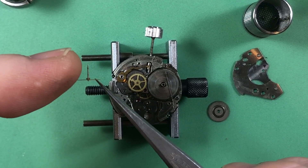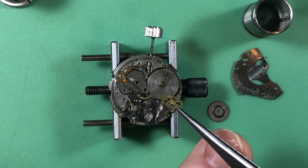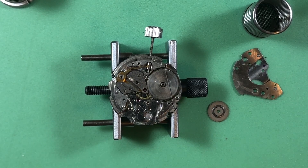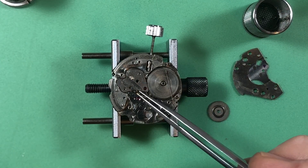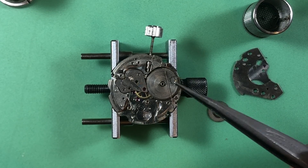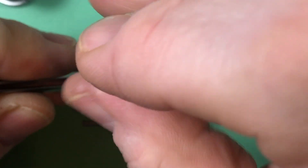We've got some corrosion around that pinion right there — right around the tip. That little band of corrosion is where the lubrication is supposed to sit. There's some corrosion on the tip of the third wheel pinion — corrosion makes the surface not smooth, so it'll eat up amplitude like crazy. You can't really polish them because that removes metal; you need to burnish them. We might have a couple of wheels that need replacing.